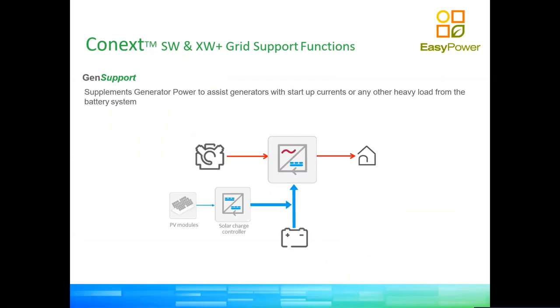So we have then the last mode that we're going to discuss today, which is the generator support. It's rather simple. This generator support is there to assist on microgrids where you need to boost the power of a generator. Since a generator in a microgrid will want to be chosen close to its maximum base load, it would be very detrimental to the fuel consumption and the maintenance cost of the generator to have to size it 2 to 3 times bigger than it should be for base load just to cope